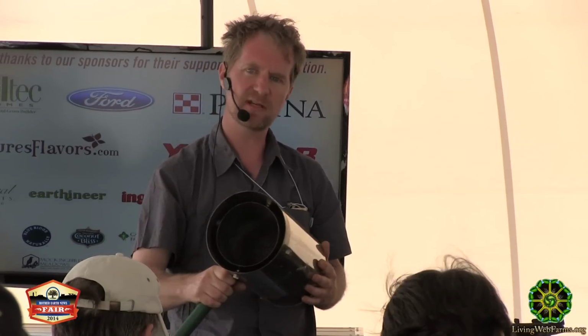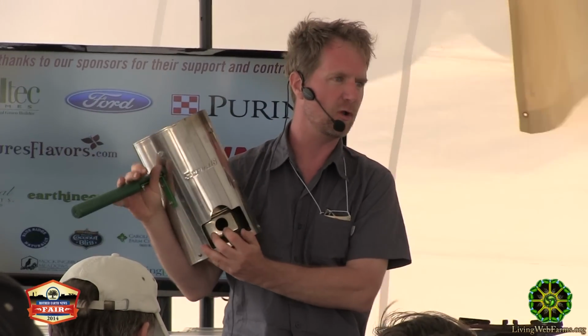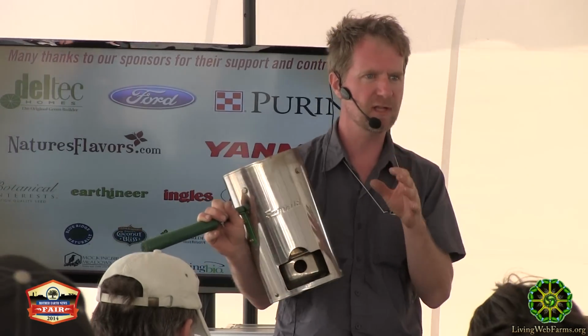And like I said, it's called a top lit updraft. We're going to light it on the top, and that starts sucking in the primary air through that small hole. Now that hole is small for a reason. You don't want too much air going in there because you want just enough oxygen to create just enough combustion to start pyrolyzing that wood and turning it into wood gas. No solid, including wood, burns.